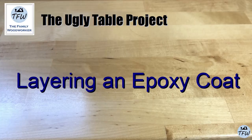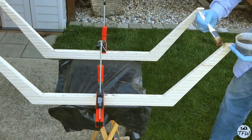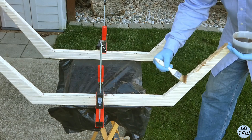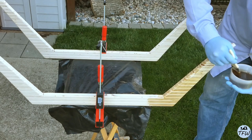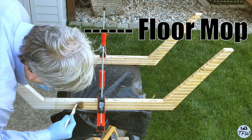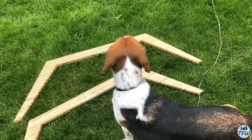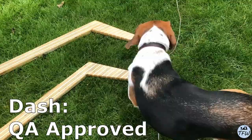Anytime you're working with epoxy — this was just some inexpensive home center epoxy — this stuff really stinks. You need to wear rubber gloves, read all the safety instructions, and in this particular case it's always best to work outdoors. I laid it on there pretty thick and then smoothed it out; I really wanted the wood grain to drink in the epoxy. Then we let it dry. Dash, our Wonder Beagle, was there for quality assurance — he just preferred I throw it as a stick. But they look really nice just as is without the finished sanding.